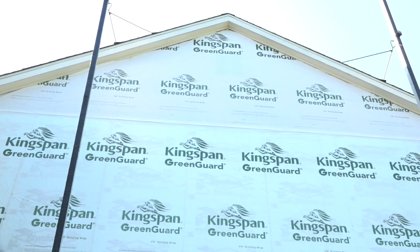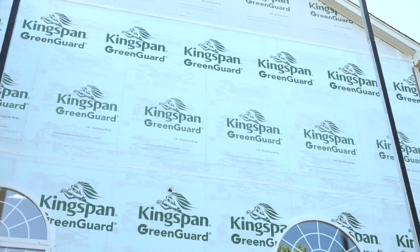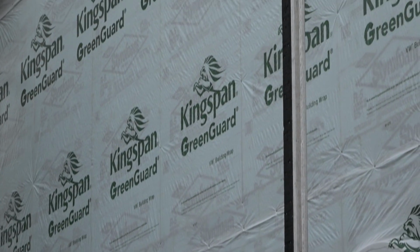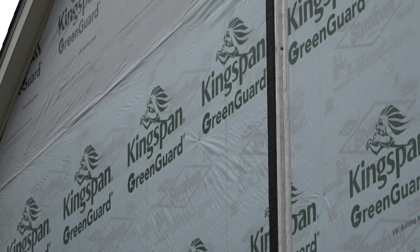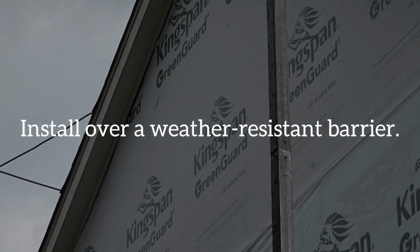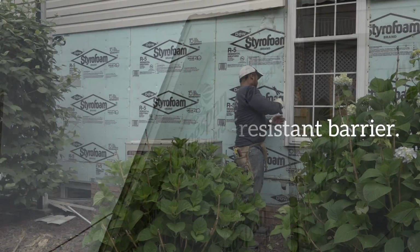Proper surface preparation is a critical step to a successful Everlast siding installation. Everlast is a rain screen wall cladding. It's not a waterproof barrier. It must be installed over a quality, weather-resistant barrier.